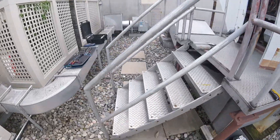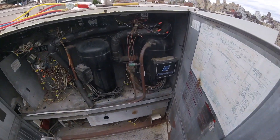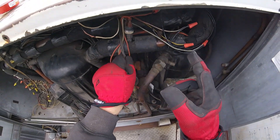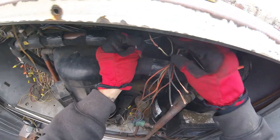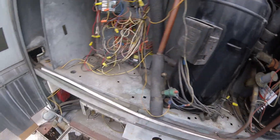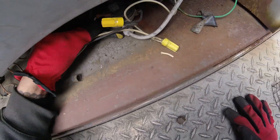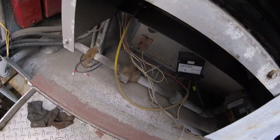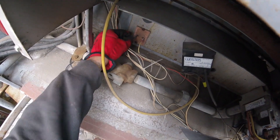So I got this what I can. Let's come around to the control panel. Got that connected. Here are those three black wires that go inside there. Got to figure that out. But we have two wires here — one is a white and black, one is a white and pink. I traced out the white and pink — it comes down here, right here, to this airflow switch. And then the white and black comes down here, right here, to our main limit.